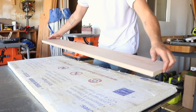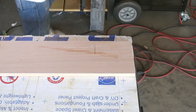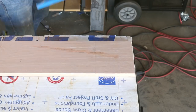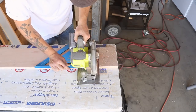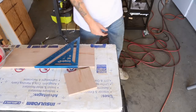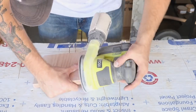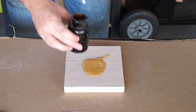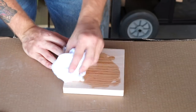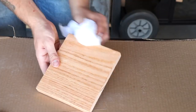Moving on to the wooden part of this project, I got that 1x6 piece of red oak I mentioned earlier and I cut it to the inside dimension of the top of the metal piece. Whenever I'm cutting with the circular saw, I always like to use a speed square and to cut on top of 1-1/2 inch thick styrofoam insulation. After sanding that piece to 150 grit, I put on two coats of Maker Brand Simple Finish — links for that will be in the description. You just apply a thick coat, let it set for about 10 minutes, and then wipe off all of the excess.